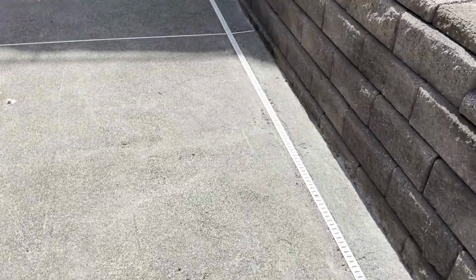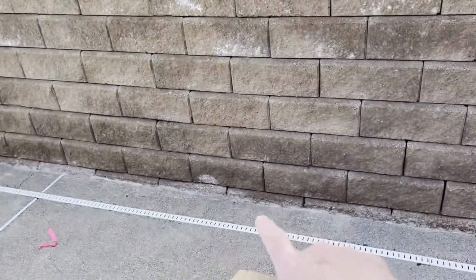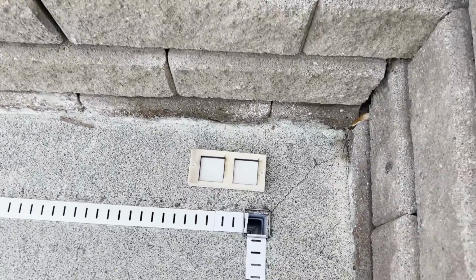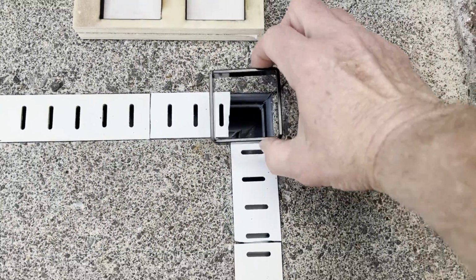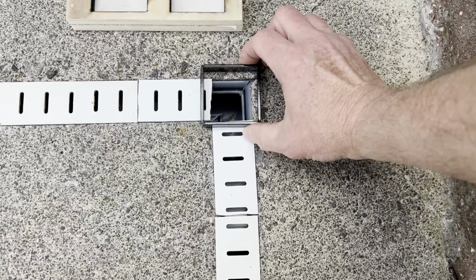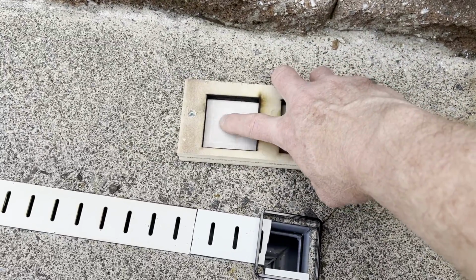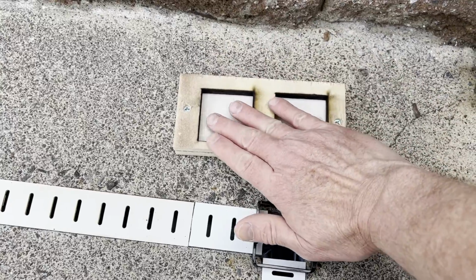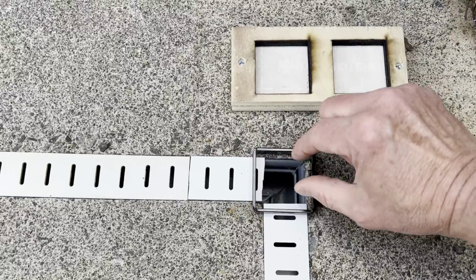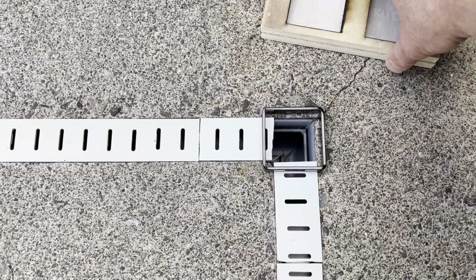And then for this drain that runs along here, they're gonna cover that up with the Pebblestone, right? But the water will seep through. So I need an access hole. So I bent some half inch aluminum, powder coated it, and we're gonna put that right here. And then I burnt this out with my laser and put some parchment paper down, and I'll have them pack some of that Pebblestone in there, and I'll use that as a plug to put right here. So I can access this and flush out the pipes if they ever get clogged up for some reason.